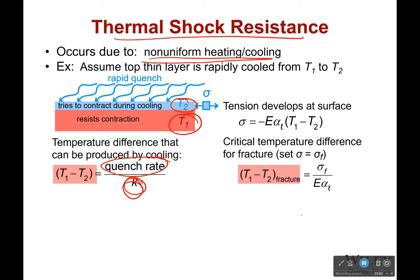I'll give the example of a log that's on fire. You can have one end of your stick on fire, but it doesn't have very good thermal conductivity, so the other end of the stick is not all that hot. The second thing is we have to remember that that temperature difference will lead to a strain, and that strain will cause an internal stress.